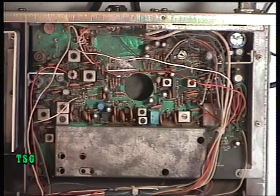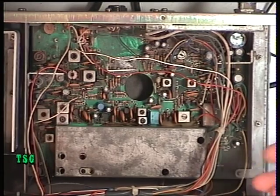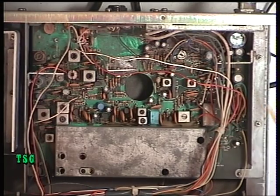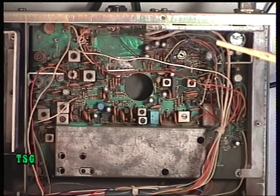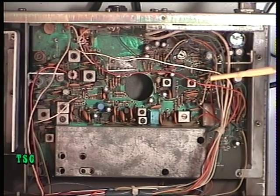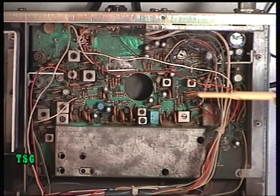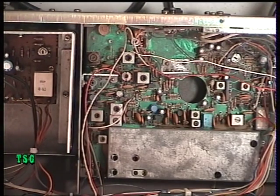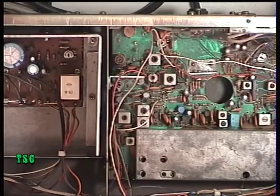The rest of the radio is the Tsuruga chassis as used in the Grandstand Gemini and the Telecoms TC9000. Under this tin you've got the IF and the synthesizer, all filled with wax, and there's a corresponding can on the other side you'd have to take off too. It's got an unusual audio IC. On the back there's a tape recorder socket which is very useful, but bear in mind it only records the received signal, not the transmitted signal. This is my own personal property from my own collection, not a customer's.